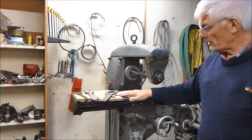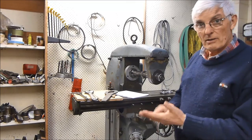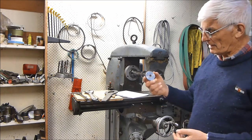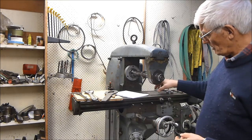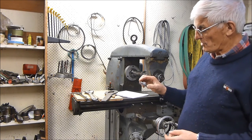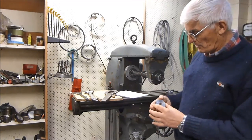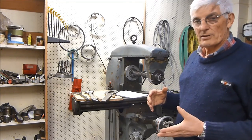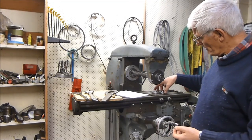So that's a quick rundown on the mill. The next series of videos will be firstly a few minutes on making a mandrel to make the gears, then cutting off the gear blanks, and then the third or fourth video will be cutting the blanks on the dividing head. There's also one video on the method I used to cut these gears because I didn't have the correct indexing plate for the dividing head, so I show an alternative method of cutting a gear when you don't have the right plate — and it did work out reasonably well.